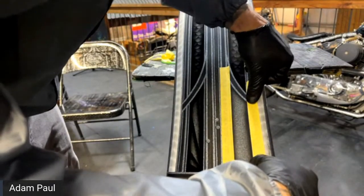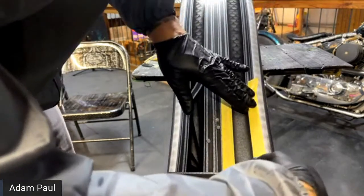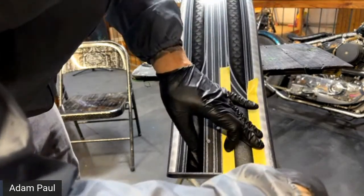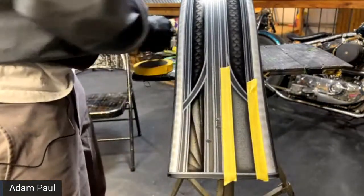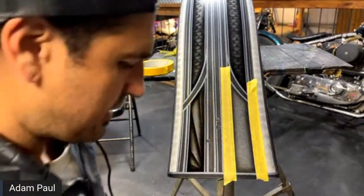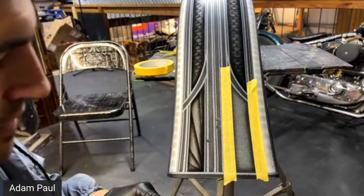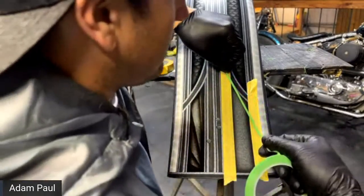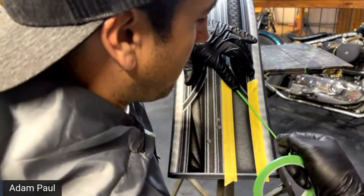Well, I use the same compressor for everything, and I have a Harbor Freight two-stage compressor. That's the key, is to buy a two-stage. Some people think that just because you have a big tank, you're going to be okay, but really, you need a motor and a pump that's strong enough to refill it without it dropping in PSI while you're working.